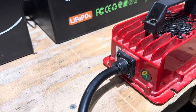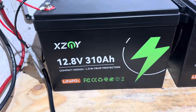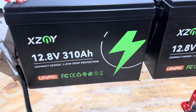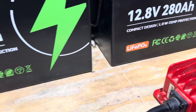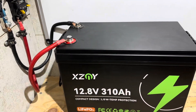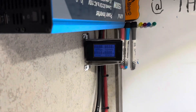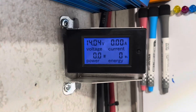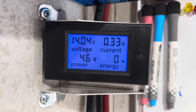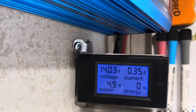The 310 amp hour unit is fully charged on the commercial NOCO charger. That 25-amp charger takes a while on a big unit — the standard charge rate is 40 amps, so I probably need a larger charger. I've pulled it off and hooked it to the capacity test rig — the Alpha inverter — the same rig I always use. Battery is sitting at 14 volts with no energy through the meter yet under a 5-watt idle load.